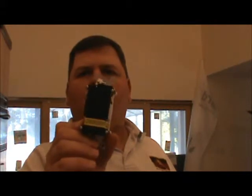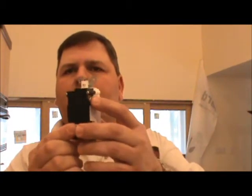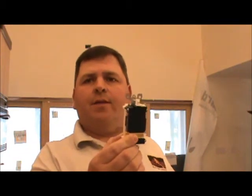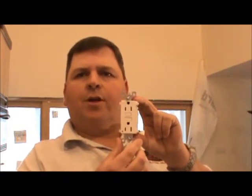The circuit flows through the GFCI outlet just like a standard outlet — it's connected in the same manner. On the back you're going to have screws where the wires are connected, and you're going to notice a silver screw, a gold screw, and on the top a green ground screw. The ground screw is green, the neutral is silver, and the hot wire or colored wire is gold. When I say colored wire, that's any color except green or white — white is always your neutral, green is always your ground, but the ground can also be a bare wire inside your home.